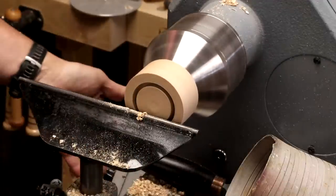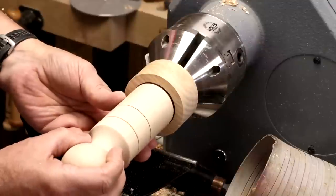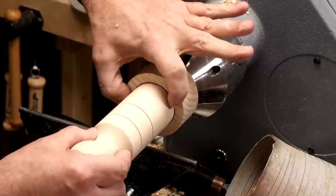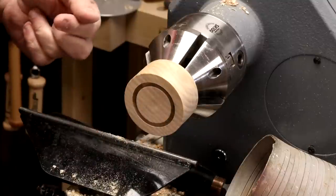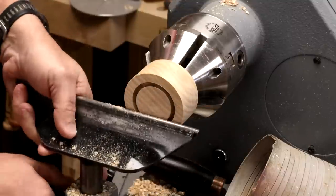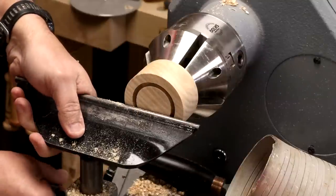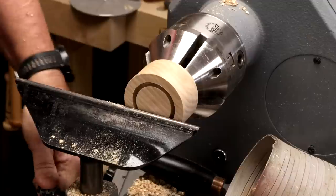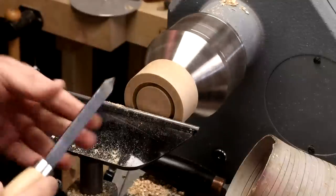And then I want to check, make sure that I've made any silly mistakes. Check if that'll fit. So, right, the external diameter is perfect, but the internal one is still a bit too big. So I need to get that down a little bit. And remember, it was a 10 mil hole that we drilled in the bottom, as in a 10 mil deep hole. So 3/8-ish, a little bit bigger than 3/8.